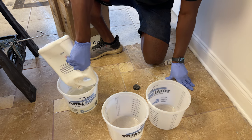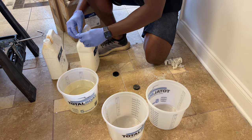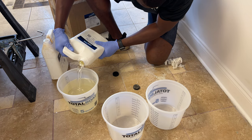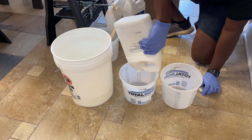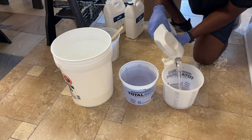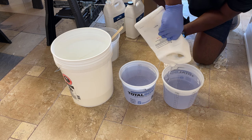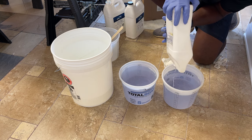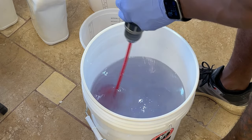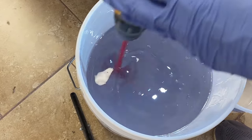Total Boat did sponsor this video with epoxy — we're using the best of the best. It's a two-to-one part process: two parts resin, one part hardener. We split the buckets so we can get as much as possible within our five-gallon bucket with even ratios. If you aren't aware, Total Boat has a bucket with a handle down below — it's the most effective bucket you can use when pouring deep pours or a lot of epoxy, because the buckets get heavy and if you don't have anywhere to hold it, it's hard to maneuver. I'll have it linked down below.